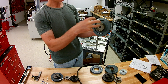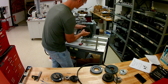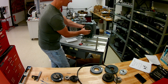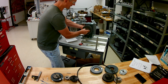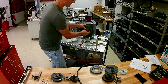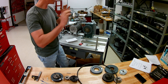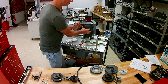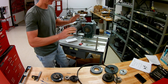These taper locks come in all different shapes and sizes — there could be four bolts, three, or two bolts. Installing this onto the shaft, we're going to make sure that the key lines up. Notice how I'm keeping my fingers in here to keep this separated from this — that's a really important step. If this goes together too much and there's enough tension, it'll close that gap and eliminate you being able to assemble it on there. Once you get it close to where you want to be on the shaft, don't stress over alignment unless you need it for pulley alignment — as you tighten up, the pulley will actually come over, so you can lose alignment and sometimes have to anticipate that. Don't overthink this right here.